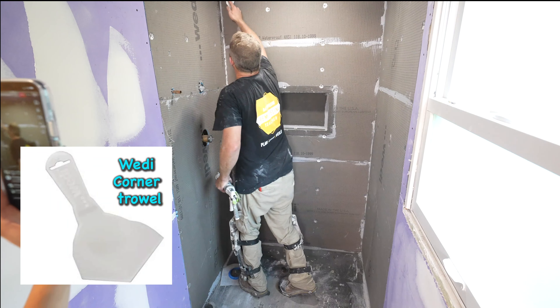This doesn't spread all that great when the surface is wet. It's not necessarily going to hurt the bond, but it's definitely nicer when everything is dry. You just have to be a little more diligent at getting a nice coat on this if you have any wetness. Use the quarter-by-quarter trowel with this thinset — whatever the wettest ratio of the thinset you're using is what you want to do, to make sure you have a good bond with your substrate. Use the back side of the trowel and key it into the subfloor — that makes it easier to spread your thinset and get nice trowel lines.